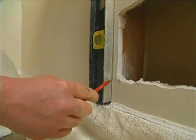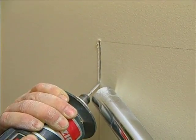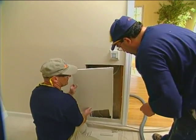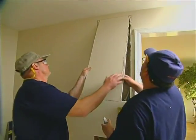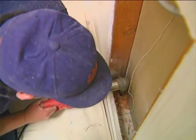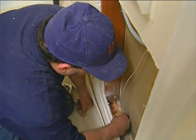The contractor doing any kind of residential fire sprinkler work has to have the tools to do what has to be done in a clean manner, and that would be drop cloths, plastic, a good vacuum, and having some tools that a lot of times woodworkers would use, a nail gun, utilizing like a Rotozip for cutting sheetrock, good wood boring tools, those types of things where you can do clean cuts. So a lot of the tools you'd have would be tools that are not common in the sprinkler fitter's toolbox, but tools that make the job easier, particularly when you're working in wood construction.